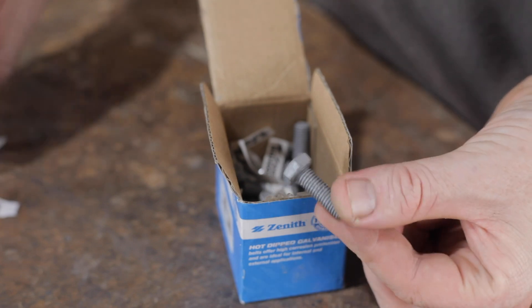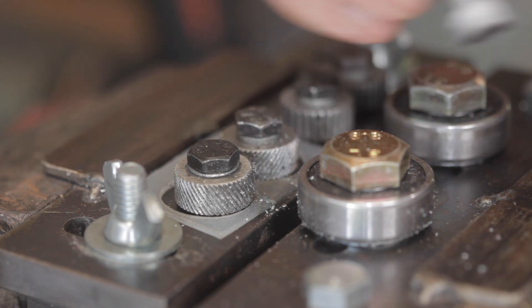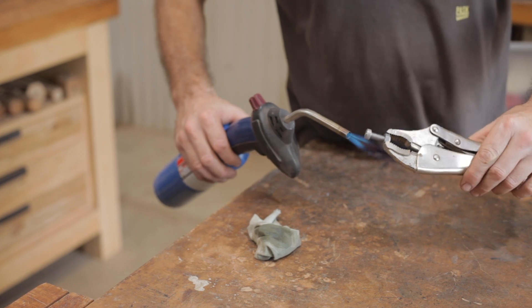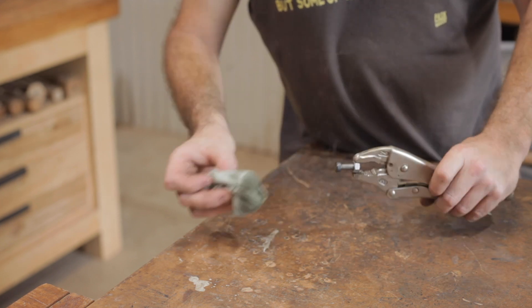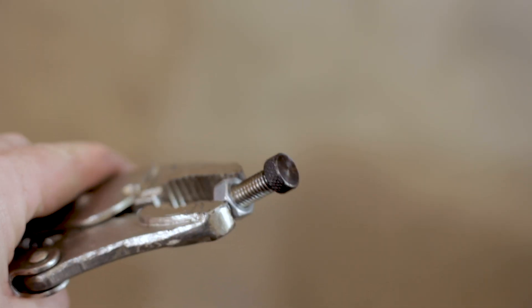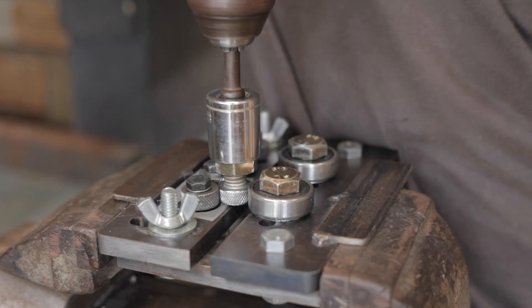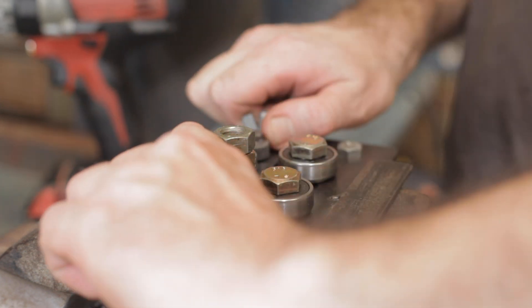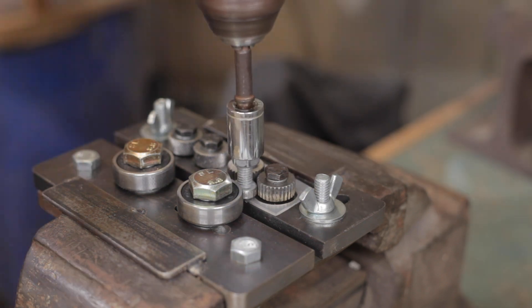Next I'm knurling a galvanized bolt with the intention of giving it a black patina — the knurling came out really well on this one. I'm sanding a chamfer on the top and bottom edges, and I ended up doing this to all the bolts. For the black patina: you just heat it up until it turns a color, ideally around a straw color, then with a rag soaked in boiled linseed oil just wipe it on and keep repeating until you get the effect that you desire. I'm also experimenting with a stainless steel bolt — I wondered if I softened it by annealing it first whether it would knurl any easier. It only took a minute to heat up and after it cooled down I gave it a go, and I reckon it worked better.